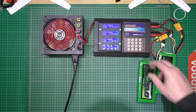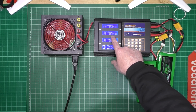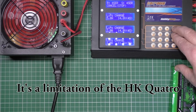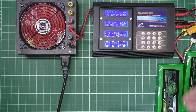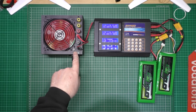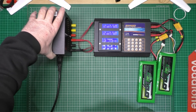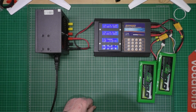We have power. Now I don't think this thing will actually charge at 5 amps at 14.8 volts or 4S, but it only goes to 3.3 amps. So there you go - there is your PC power supply converted to a nice power supply for your lipo charger. And like I say, that's going to sit like that, so it's absolutely perfect. Job done.